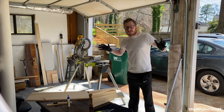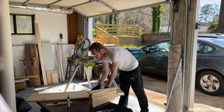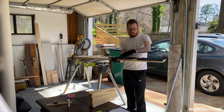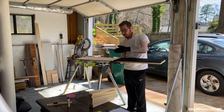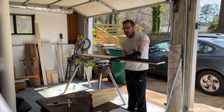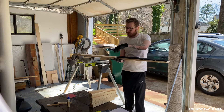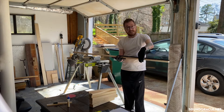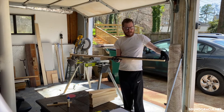All right, so now we're out in the little workshop — a little corner of my garage. I've got a long board left over, and I'm just going to set the panel right on it and cut right there so I know exactly how even it is, then do the same with the other wood boards. One thing I do want to point out before we dive in: you're going to be working with Rockwool, so I recommend gloves, long sleeves, and safety glasses — especially with saws. Stuff can get into your eyes, and Rockwool can irritate your skin.